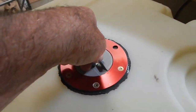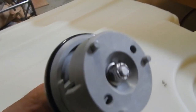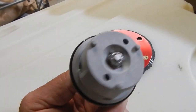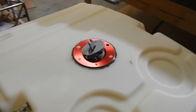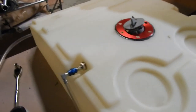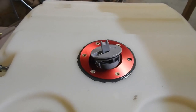after you put it in, it rotates and then snaps down. If this nut on the bottom is too loose, when it snaps down, it doesn't create a tight enough seal with this gasket. So I tightened this up a little bit and adjusted it, and then I repressurized the tank and it held. So not only did I not get bubbles on my fittings, fittings all look good. The tank cap needs to be adjusted also.